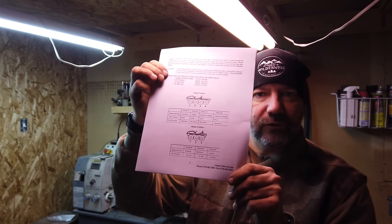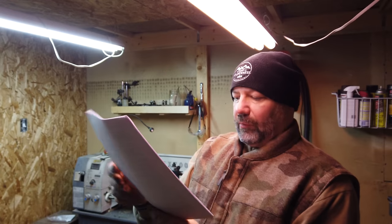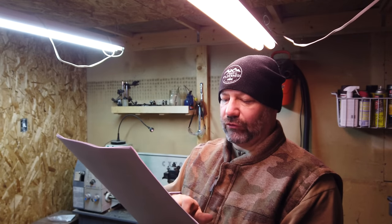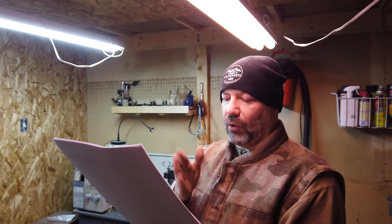At this stage we've pressurised all the tyres to exactly 5 psi. According to the instructions, we measure each of the tyres and use the circumference to sort them. We put the smallest set of tyres on wheel one, which is the front, the medium-sized in the middle, and the largest tyres at the back. My tyres range from 161 cm to 164 cm. They're currently set to 5 psi, and I have to drop the front down to 3.5 psi, the middle to 4, and the rear to 3.5 — so small, medium, and large in the back.